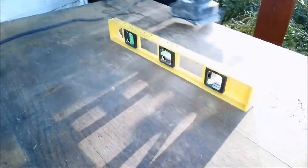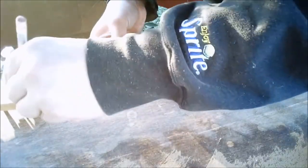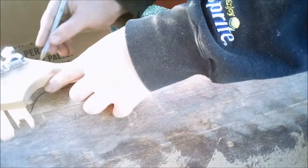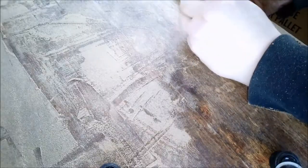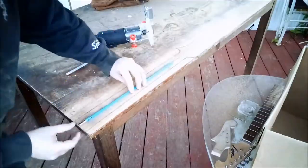The first thing I did was take a level to the edge of the table on the wood I plan on using, and using a palm sander I made sure it's level and flat. Next I used the neck from my test mule guitar to mark out a rough template, and using a level I measured and marked the center line. I took a custom headstock template I had made previously and gave that a rough tracing. After a couple of tries and some hand-drawn artistic freedom, I wound up with this.